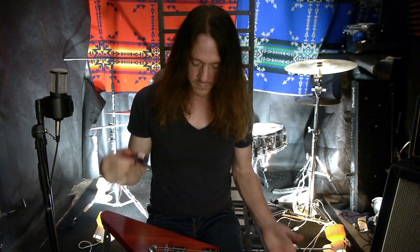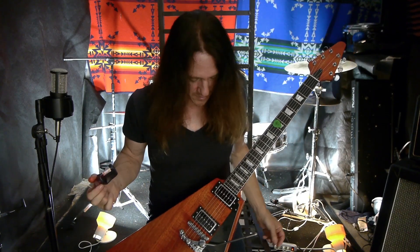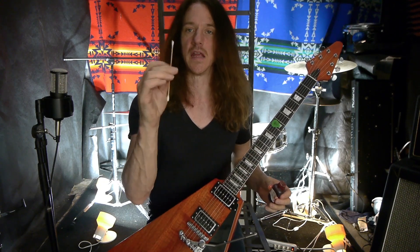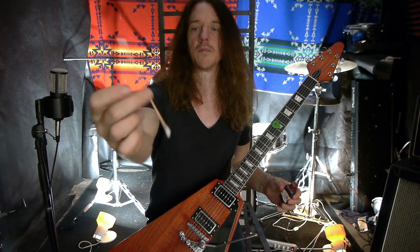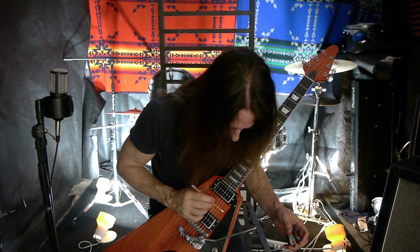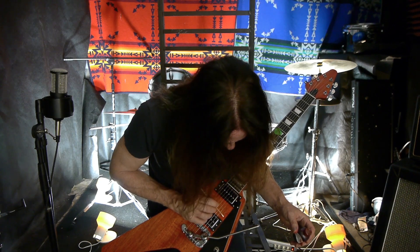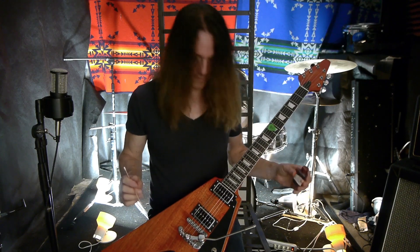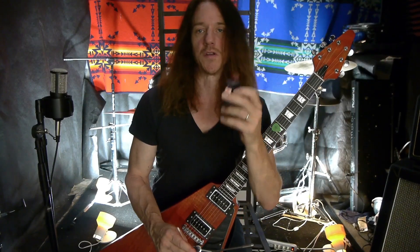That looks really good, I'm happy with that. Wood tone stain is really easy to touch up — just keep one of your bottles. I used the second coat color and touched it up very carefully. That spot's going to happen again because it's where I pick, but I'm just not ready for it to wear out. I like the way the finish looks, so I'm happy touching it up. Really easy — just use one of these fine electronics Q-tips. Thanks again for watching. I highly recommend this wood tone stain. I'll see you next time.